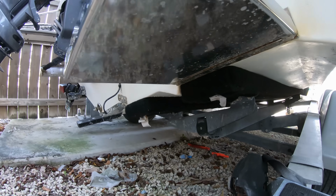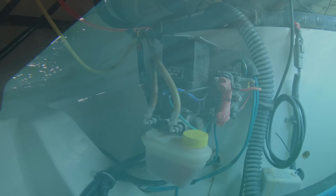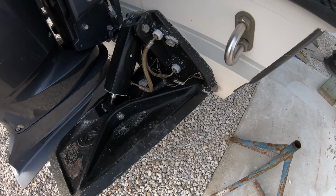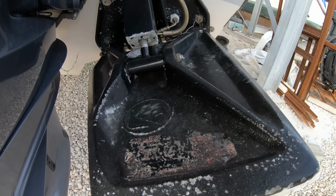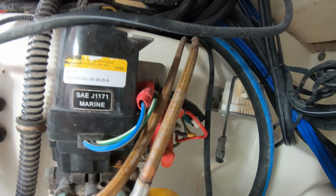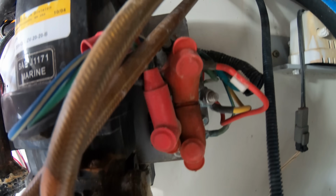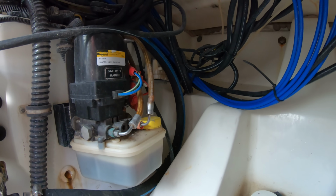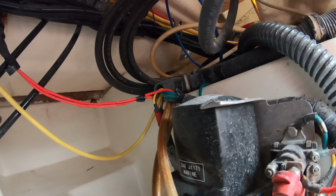The electric trim tabs operate by sending power to the actuator to move it up and down. The hydraulic system, on the other hand, gets a little more involved. They have the same planes and there is an actuator, but it's a hydraulic actuator. Not all hydraulic systems have the auto retract feature, so it's something to be mindful of if you have trim tabs. Whenever the button on the console is pressed, power is sent to the two relays that are operating an electric motor that runs the hydraulic pump. That pump then pushes the fluid one way or the other to bring the actuator up or down.